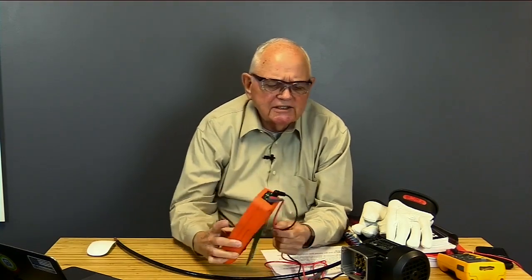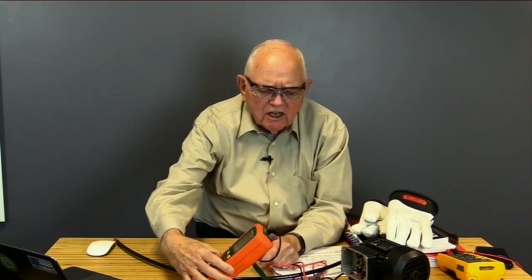That's pretty good then. Okay? Now, what voltage should I test my insulation at? Well, I don't want to go too high, because if I go too high, I can actually damage the insulation. In this spot reading test that we're going to do here in a second, the spot reading test is a non-destructive test, okay? It's a quick test that we can do to verify the condition of our insulation.